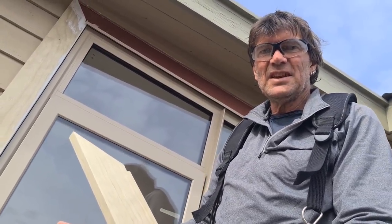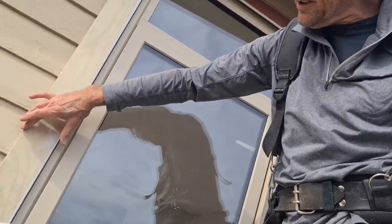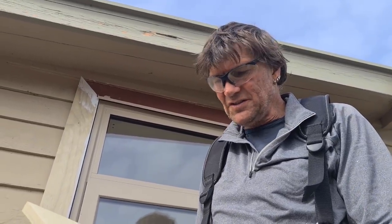What's that word? Is it arris? Arris. A-R-R-I-S. Oh, okay. Arris the edges of everything. It's all arris. Because paint doesn't stick to a sharp edge. Right. It'll just knock off. So you got to knock the corners off it so you arris it. Good tip.